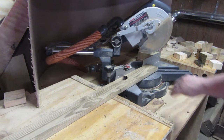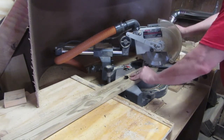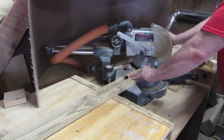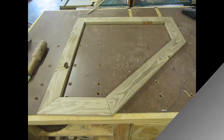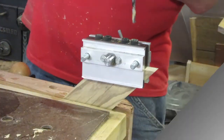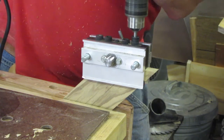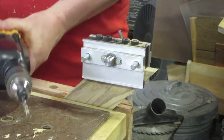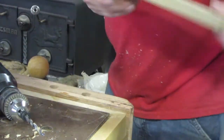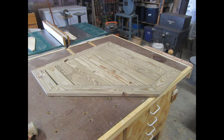For the top, I cleaned up some more deck boards and started by making a frame. I cut the right angles at the chop saw, and here's the layout for the frame. To join the pieces at the top, I'm using quarter inch dowels. I drilled the holes using this self-centering doweling jig. And here's the top, dry fit together.